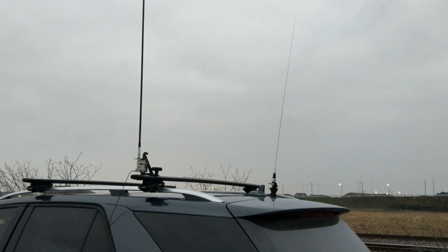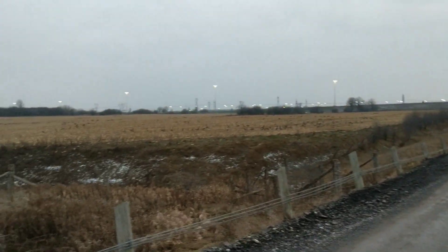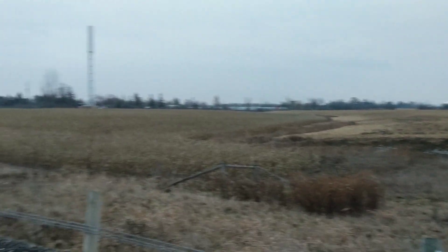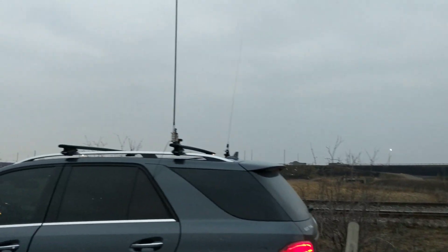The antenna behind it is a 2 meter 5/8 whip that actually works incredibly well on 6 meters — I can tune it down to 6. So I'm out here in the countryside, there's a bunch of geese in the field beside me. I sent my APRS location which popped up no problem, and it's a relatively low noise environment. It's working well.